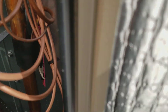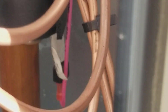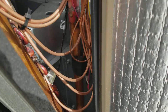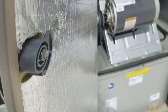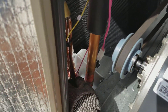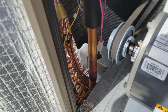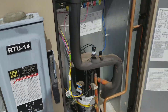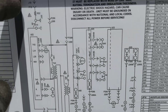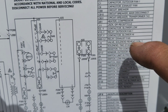I notice there's wires going down right there with the sensing bulb for the TXV. It's kind of hard to see because it's right down in there — this yellow and pink wire right here. It goes down and there's something with the sensing bulb. I found it, looked at the wiring, and found it on the schematic: R52 resistor TXV control.